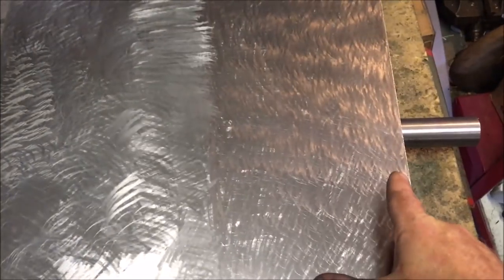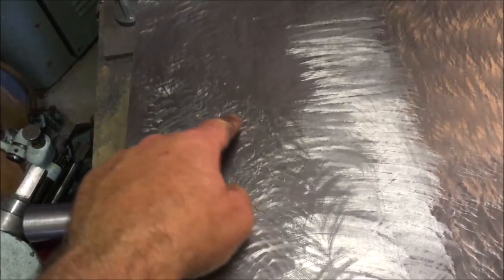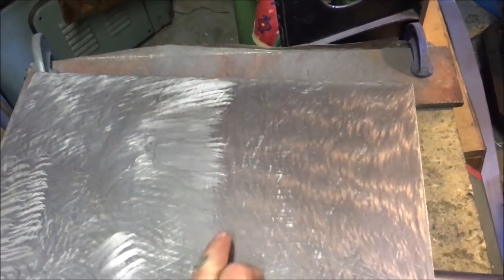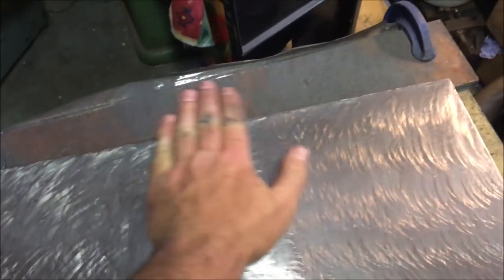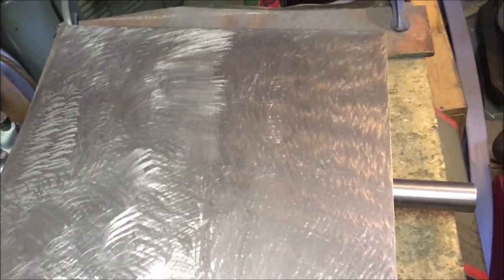I'm giving another heavy scrape. This side I've done shorter curls, about 1.5 inches long and quite tight together, so you get that kind of effect. And then that's more random. That's the area that we're trying to get down to. Unfortunately, I was planning on doing this all the way across, only by the time I got to there, the edge had gone off the scraper. So I resharpened it and then messed about down here and everything went to pot. So I had to re-hone it again. Anyway, be interesting to see how the spotting picks up. I'll bring you back when we've done it.